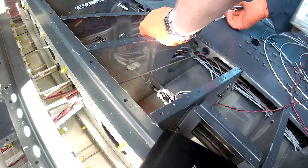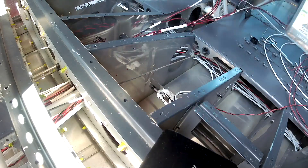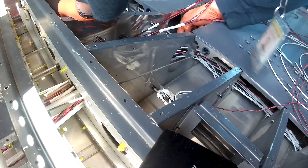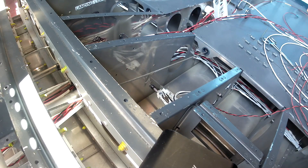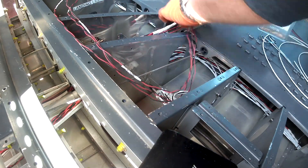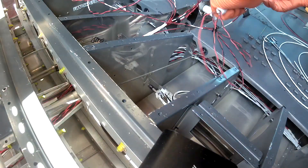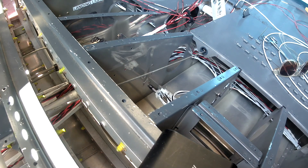You can see I've got a bundle of power wires put together — one for the left side, one for the right side — and I'm sticking them through all the different snap bushings and flanges. Some of that goes out towards the wings, some towards the tail, and all of it winds up going towards the panel where it connects to the circuit breaker board. Power stuff coming from the back — with the exception of lights, which go to breaker switches, and pitot heat, which goes to a switch — everything else goes to circuit breakers.